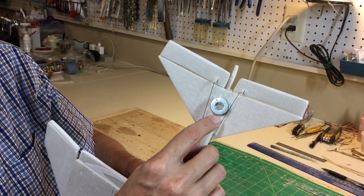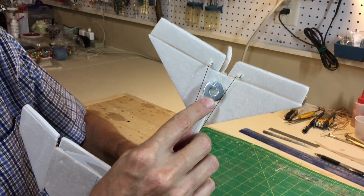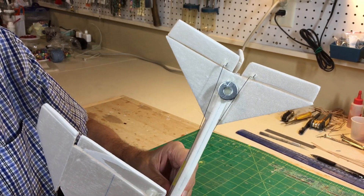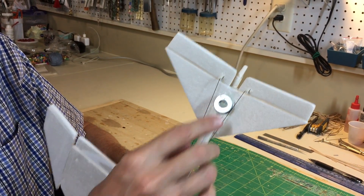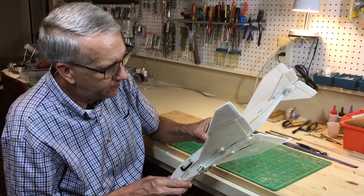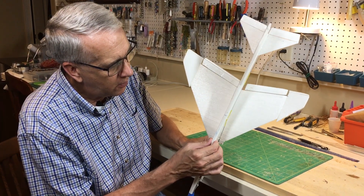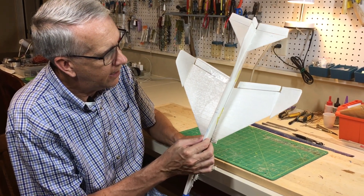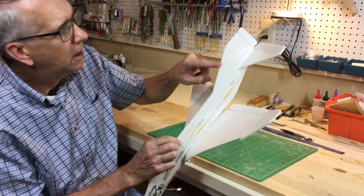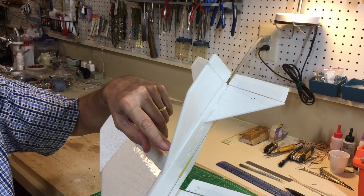The catch was I had to hot glue in two washers to make it balance out, which brought the total weight to 2.1 ounces. I'd very much like 1.7 ounces, but I can live with 2.1. The fuselage is two widths of foam board, 3/16-inch wide, as necessary for rigidity. The fin and rudder is just a single sheet of foam board, 3/16-inch wide.